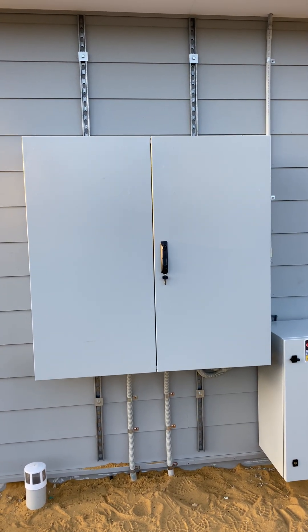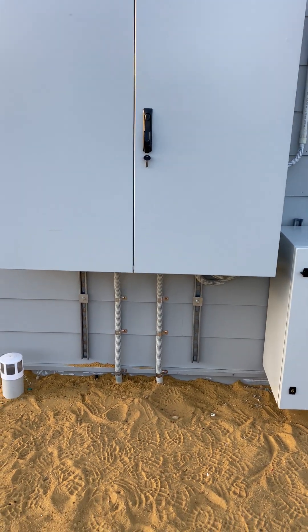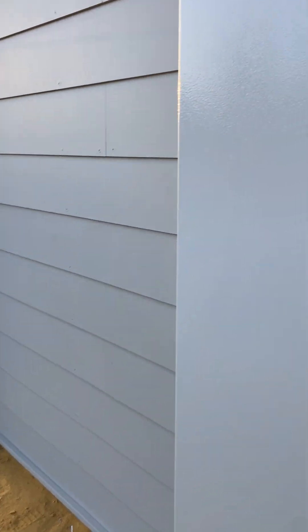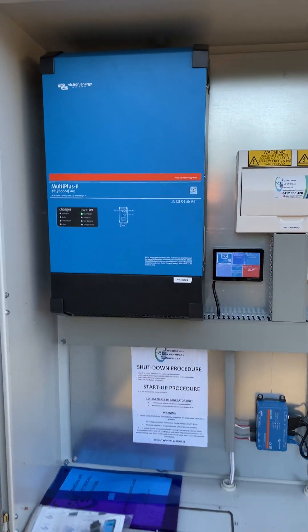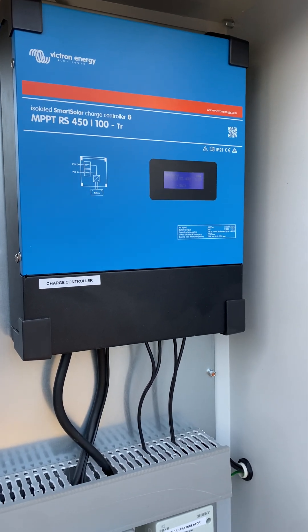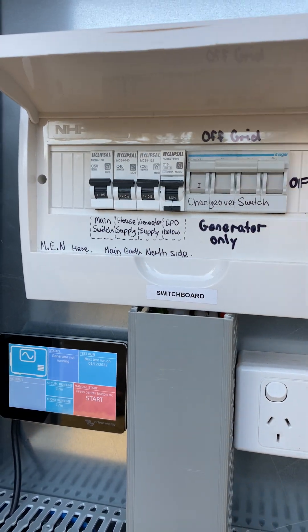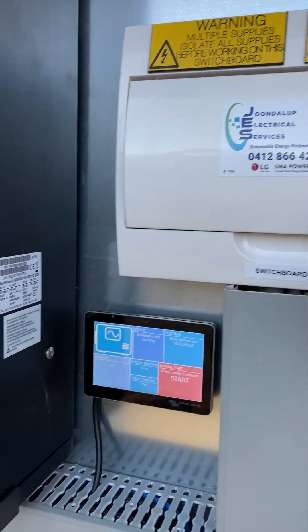This is a steel-framed house and I've mounted this one to the wall — it's extremely solid. Unfortunately I couldn't run my conduits in the cavity because there is no cavity, but this side will actually all be enclosed anyway and it's apparently going to be a cat run. Inside the cabinet you've got your inverter and your charger — that will charge from the generator if need be — and the charge controller there, which looks after the solar charging. There's also a switchboard with a generator changeover switch so we can switch to the generator in case the system fails.